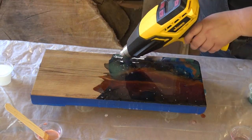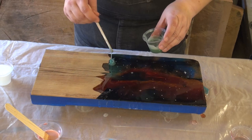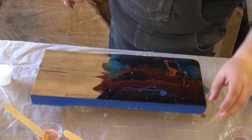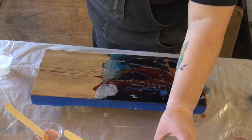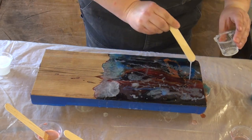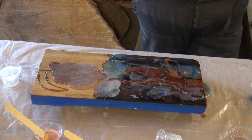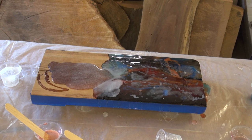I did three different layers of resin. I also finished the plain side by putting clear resin on top of the barn wood because I wanted a consistent gloss finish across the whole entire top surface. After giving it time to cure I removed the tape — painter's tape around the outside — a tip I picked up from someone who works with resin all the time.